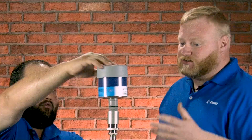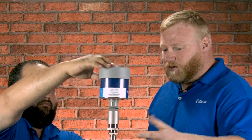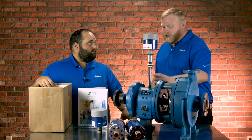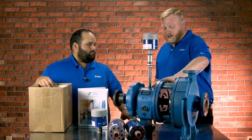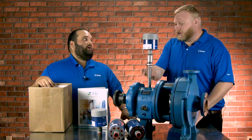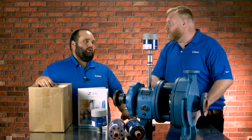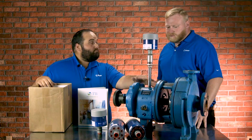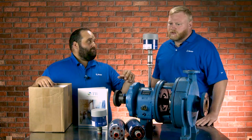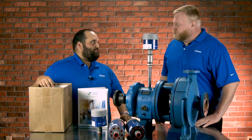There are a couple of benefits to using an adapter. Sometimes thread sizes don't match up, so we'll use an adapter. Another great utilization is tying in a 6-inch to 12-inch nipple, or maybe a couple of 45s or 90s. The reason we do that is because with splash pumps, we can have issues with oil misting that gets up into the system and cakes the bottom of the desiccant. It's a pretty turbulent environment, and if oil mist coats the desiccant, it's pretty much useless at that point.